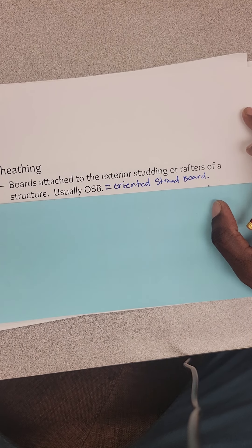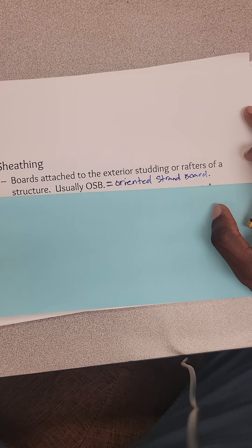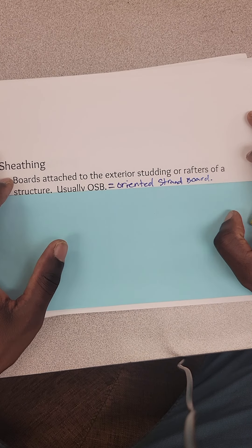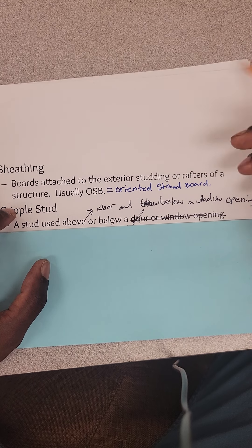One important thing about OSB: you have to be careful because OSB likes to swell. If you get it wet it's going to foam up and it's no good to you — you'll have to cut out that bump and use it for a different section. On job sites they say don't open the OSB until you're ready to use it for sheeting so it won't swell from the weather. They also put felt paper or water barrier paper behind the sheeting to really support the OSB structure so it won't get wet — basically waterproofing.